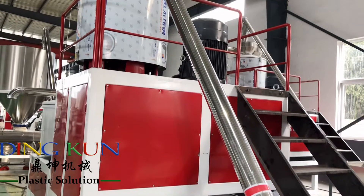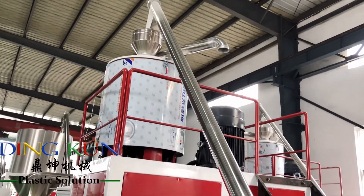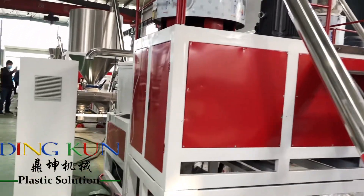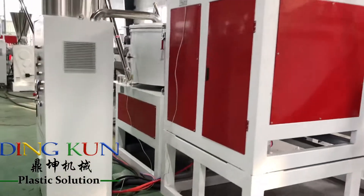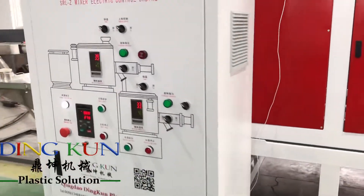The whole line consists of a conical twin screw extruder, double cavity mold, vacuum calibration cooling tank, haul off, laser printer cutter, tripping table. Line speed is controlled by inverter, and haul off machine is controlled by servo system. Using this machine we can produce two pipes at the same time.